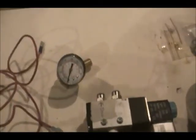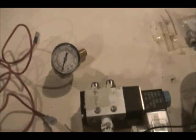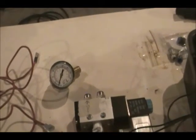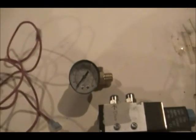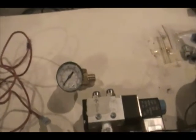Flow control — that's where things like this come in. With this, you can control how much pressure is going into a particular prop. One of the props I'm working on right now, my witch prop, is going to take probably more pressure to move that four-bar than it is to move the horizontal axis. So if I had just the same amount of pressure, that horizontal axis may be very violent where I don't want it to be — I want it to be smooth. Using this, I can control how much air is going into the cylinder and thereby control how fast it moves.